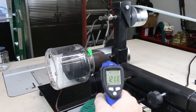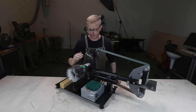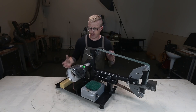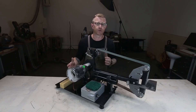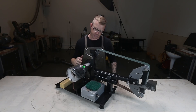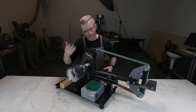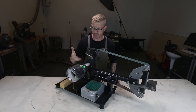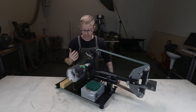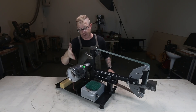As you can see, I did some temperature testing on the motor. I ran it for about 30 minutes consistently under load, and it gets up into the mid to upper 120s — it hovered around 121–122 for a period of time, which I felt was pretty comfortable. One thing to watch out for with these is overheating. They do have a thermal switch on them; I've since removed that thermal switch because I didn't feel like I needed it.